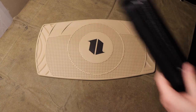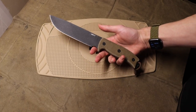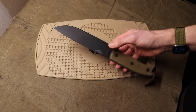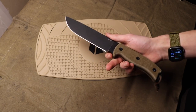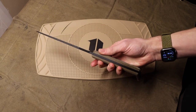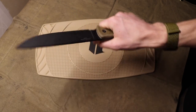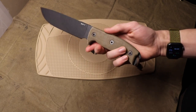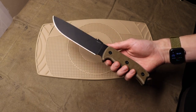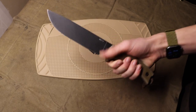It's definitely affordable, and for a few reasons — the sheath is not the most impressive, but it is very functional, keeps the blade safe, and the retention is certainly there. The blade coating is slightly lesser quality and it doesn't have the famous Rowan heat treat that the SC line has. That being said, it is still a pretty thick slab of 1095 high carbon steel and it is very comfortable. Some people complained that the handles on the RAT line were not as contoured as the SC line, but really there's not much difference — these might be slightly more blocky but still quite comfortable.